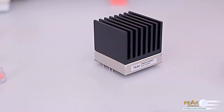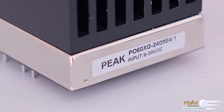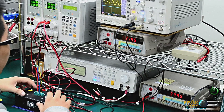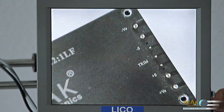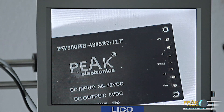And sensor connections? Higher power DC-DC converters starting at approximately 20 watts can have sensor connections. Hence, voltage losses — also called a voltage drop — which are caused by the lines on the output side can be compensated. The sensor connections of the DC-DC converter are connected with the load via two additional lines. In particular, this function is used with low output voltages, for example 5 volts and less, or when very precise voltages must be applied to the load, for example in instrumentation.